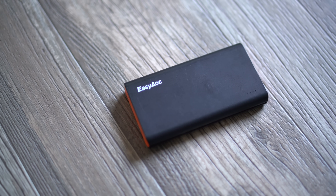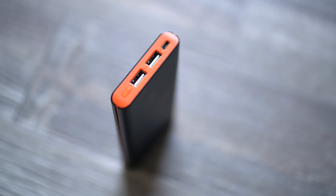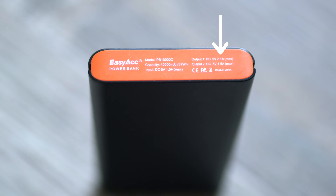For high amp output and discharge rate, you want a battery with at least a 30-amp output. Many people send me links to a 10,000–15,000 mAh power bank found on Amazon for $40–$50 asking if it's a good option — it's not. Those packs are designed to output only one or two amps to charge a smartphone. Using them at even three to five amps would damage them; at 30 amps they'd probably burst into flames. Just because a battery has a large capacity does not mean it will work for an electric skateboard.